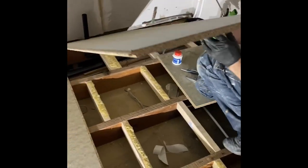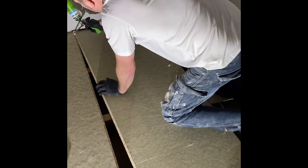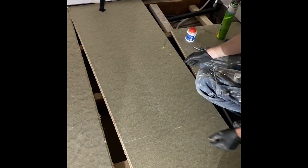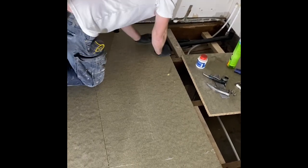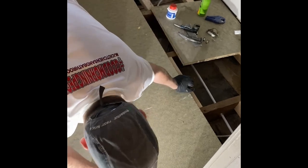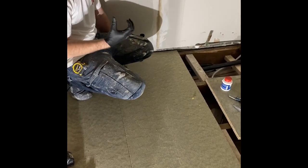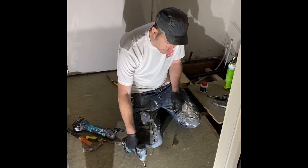I've done it again, foamed all my fingers, that's with adhesive. But before I slide it in, that's what this stuff's good for. There's plenty in there. And this is why I always put the bigger lip on the bottom, so I can get it in. I just need to notch that out a little bit so I can move that forward. But you've got about 10 minutes before it really starts getting sticky, and then it won't move. Once you get your board in there and you get it nice and tight, don't try to put a screw in there because you'll push this board out.